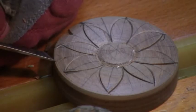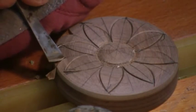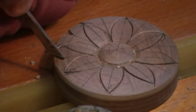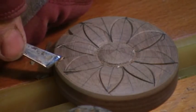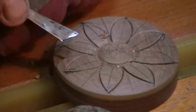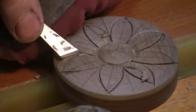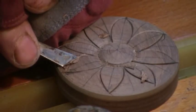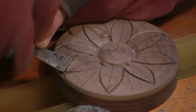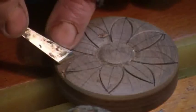I'm going to come back with a little flat chisel and clean that out just enough to get a good little notch in there. If I'm not deep enough I can ease — you're not going to get all this in one pass, so just sneak up on it. This is just a little straight skew chisel, nice and sharp. One of the things with carving is your chisels have just got to be sharp. All I've got to do is do that little back cut, then come right in here and start on an angle taking this in toward my petal, side-cutting down on an angle rolling with the curvature of the piece. The cut in the petal actually gives you a nice little stop in case you try to go too far.